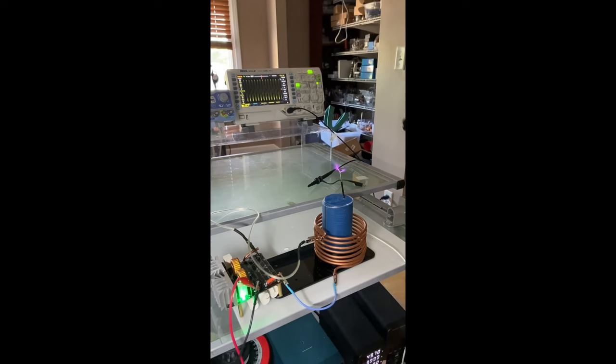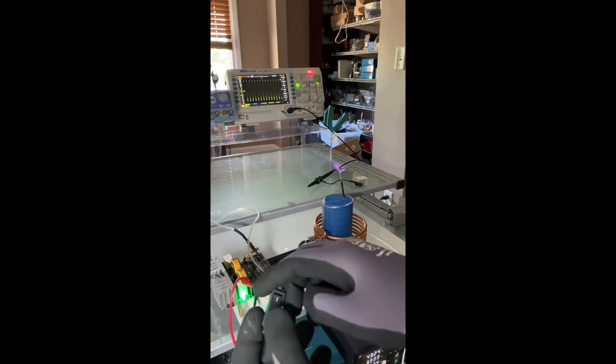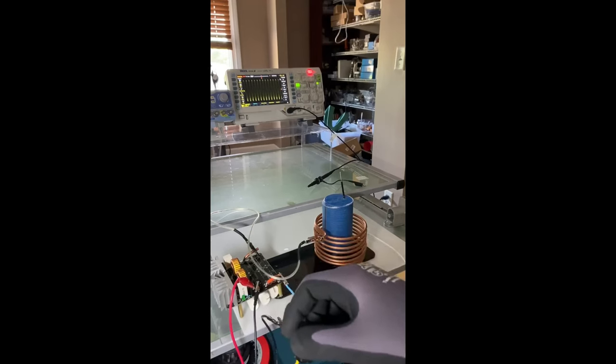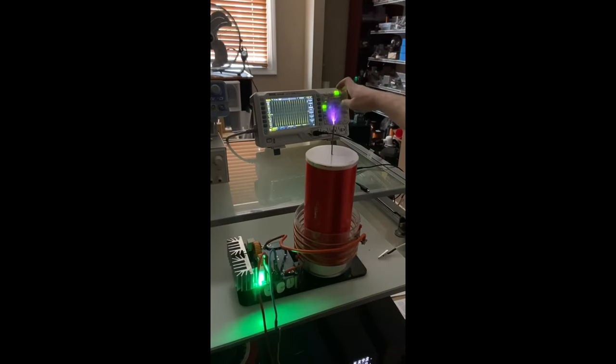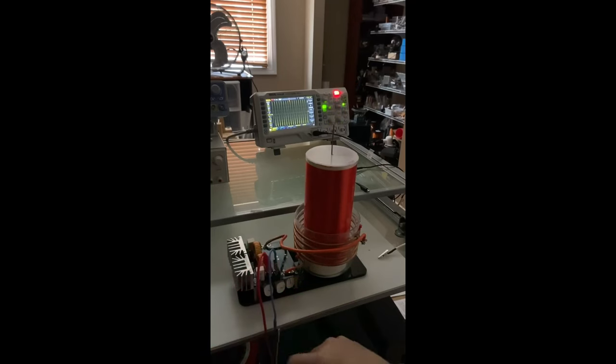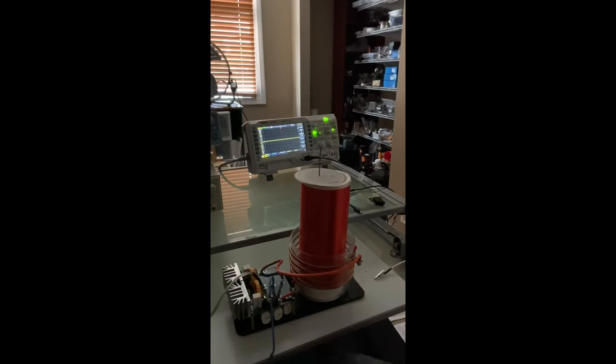What happens if you go out of that range? In this circuit, you're not going to be able to reach that with your number one coil. Best advice? Keep the frequency of your number two coil at 300 kilohertz. Second part of the advice, don't be like the old man. If you know it's out of frequency, stop what you're doing, get a coil in frequency, then resume your test. Do not continue to burn things up.